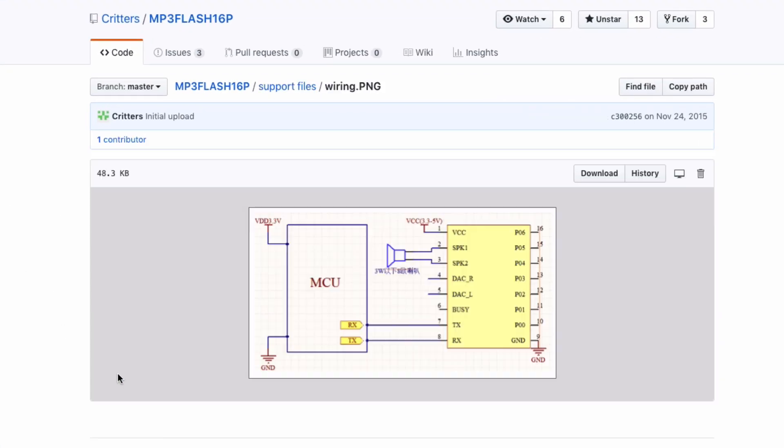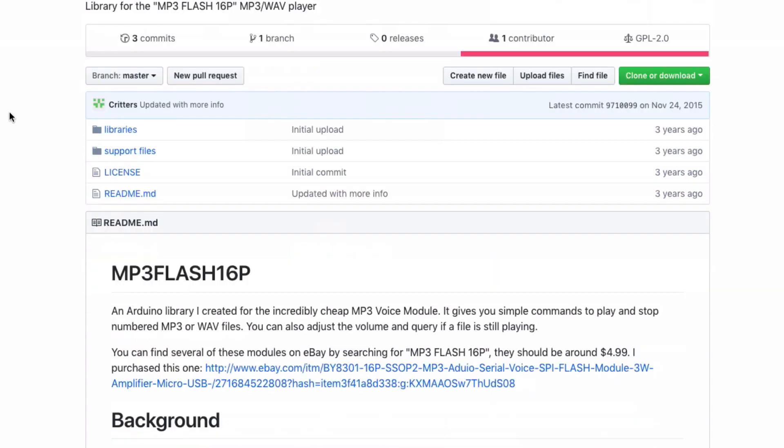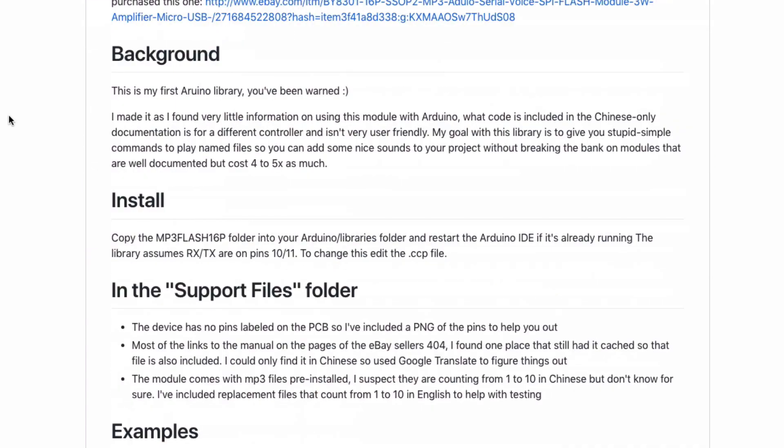Even better for people who are into cosplay or who just don't want to use a microcontroller, you can actually play back MP3s by connecting pins, but that only restricts you to a few files. When you use SPI and a microcontroller you can use as many files as will fit on the drive. Each audio file you want to play has to be numbered, and you choose the number of the file you want to play.